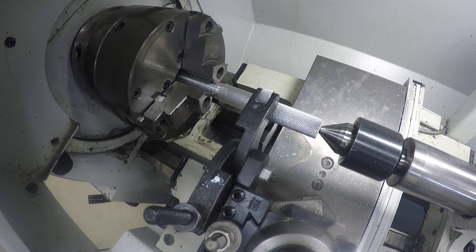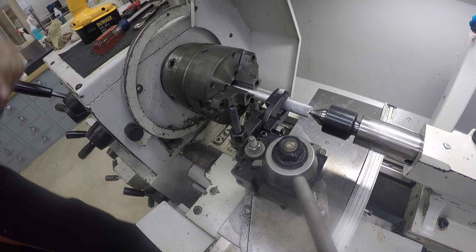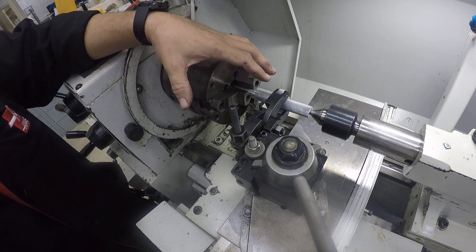It's easier to do aluminum — most of the time you can get away with one pass with that half-turn pressure after finger-tight. With steel, you usually need a second pass unless you're heavy on your half-turn. But I don't recommend too much pressure at once as that's a problem. So I'm good. Do not disengage yet.